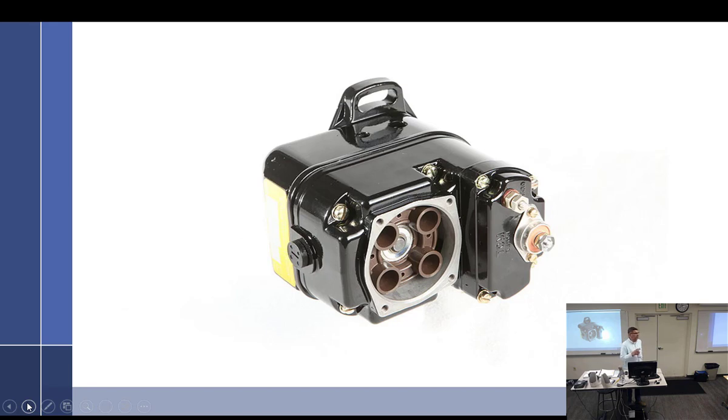All right, so next thing is we put the engine where we want it. By the way, I don't have pictures. There's other ways to do it. You should know that on the small Continentals that you're going to get a chance to, on the flange, the numbers are right on that flange. They're just on the bottom. If you want to cheat, turn it upside down so it's on the top. When top dead center is lined up with the top of the case, you're on bottom dead center. Just set your time right up, put it bottom dead center, boom, you're done.